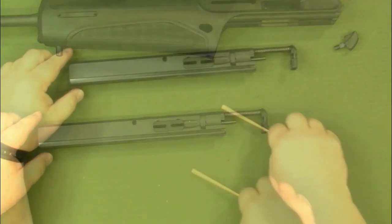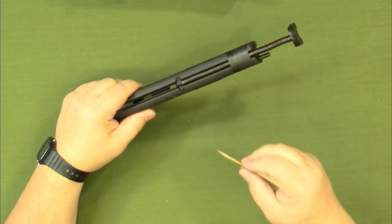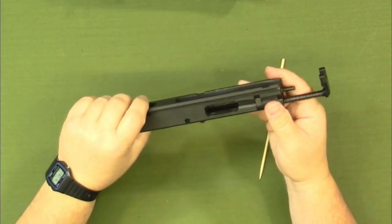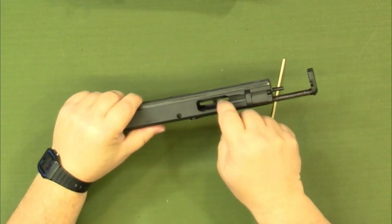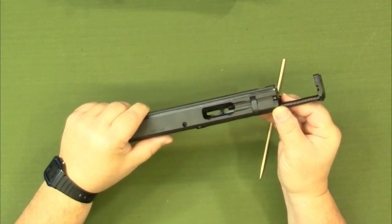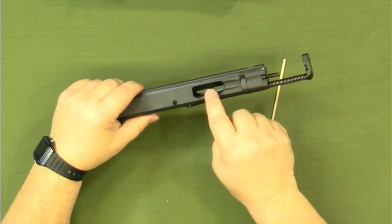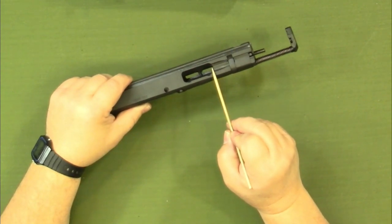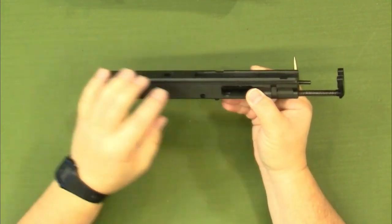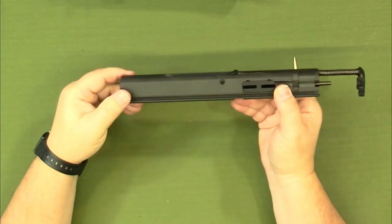The bolt itself is big, heavy, and beefy — that's because it is a blowback-operated firearm. This is our recoil spring right here. That's our ejector, which you can probably see more easily from this side. When the bolt goes back, the ejector will pop forward — that's what kicks the shell out. The extractor is right here. This is as far as you need to disassemble for cleaning. At this point you can get access to everything, wipe it all down, scrub it out, clean all the rail areas, and give it a light coating of oil.